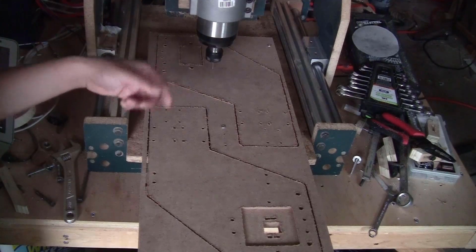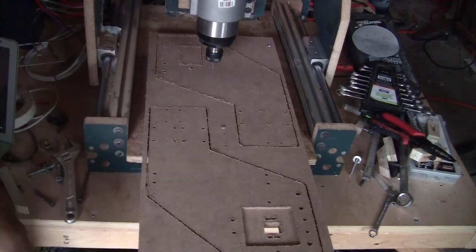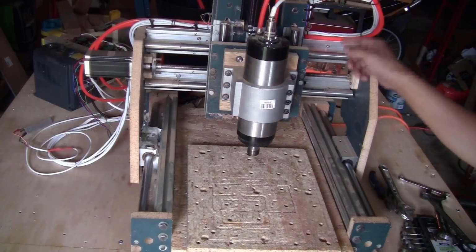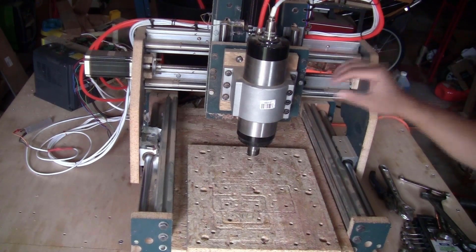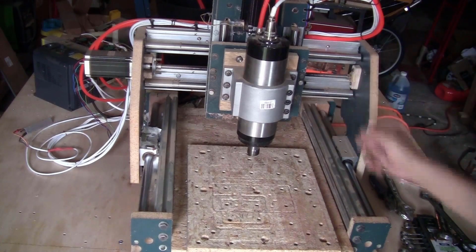Now all the pieces are milled, I'm ready to replace the leadscrews with the ballscrews. I will start by disassembling the Z-axis block, because I will have to replace almost everything on here except the rails, spindle and stepper motors. Everything else will be replaced with aluminum plate. I also will start to untighten all the wires so I can put all the components aside. Then I will have more space to work on the frame of the machine.